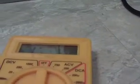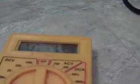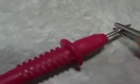What's the word I'm looking for? There's no continuity. I could not think of that word. Okay, there's no continuity in the circuit, so that means that there's an open. It's just like here when I undid the clip lead. That makes it open. If I clip the clip lead back to the positive, then we get the reading again. And I don't have a very good connection. Yeah, now we're back to 6.8. Okay. So that's basically how you would do that.